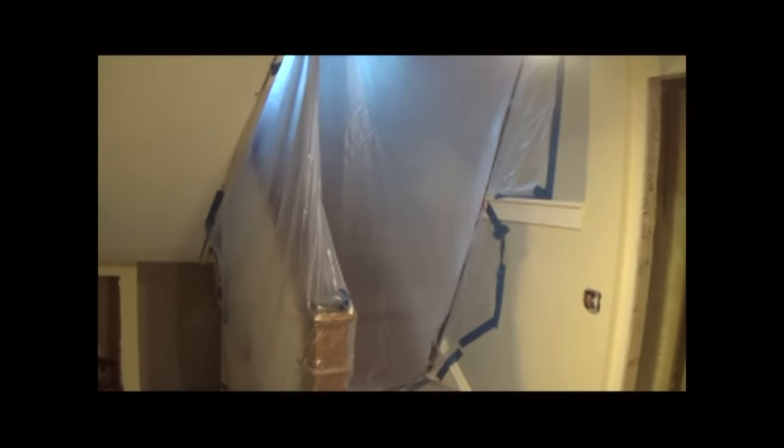Watch this. Now it's all poofed out. So there's no air going upstairs anymore. The air's getting drawn down. It's getting drawn down the stairs. So as I go to sand this now, no more dust is going upstairs. So it's just a reverse suction, and it works beautifully, guys.